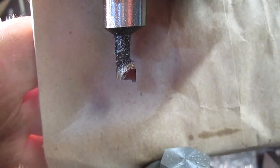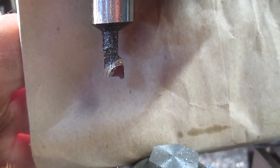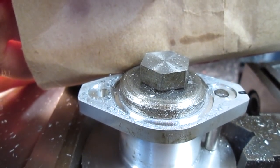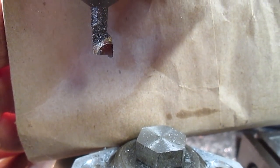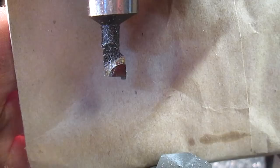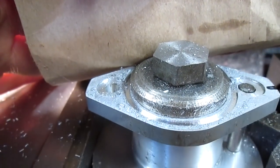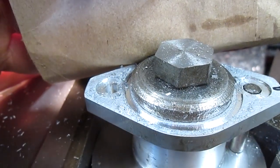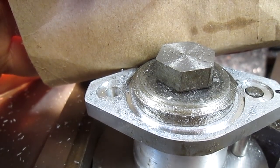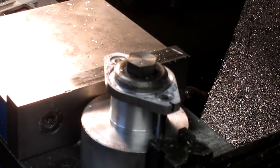Okay, we've come in and cut a bit with just a little ear on it because we need to cut the groove in this thing, and I started cutting the groove, except the groove needs to be 112 thousandths, and I cut the web just a little bit too small, so I'm going to have to come out with the boring head just a smidge. So we're going to cut the next one at this angle, at this depth of 23 thousandths, and then cut all 4 of them, and then adjust out to the right outside diameter and cut them again. Okay, we'll be back.